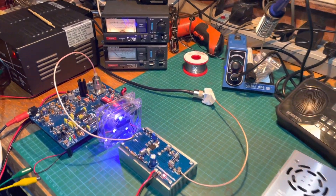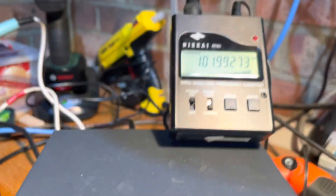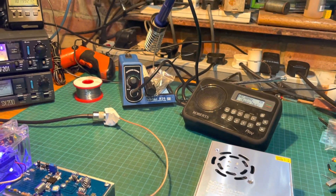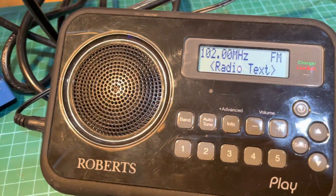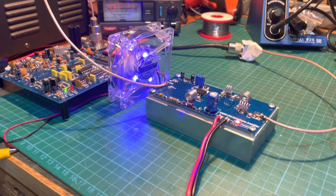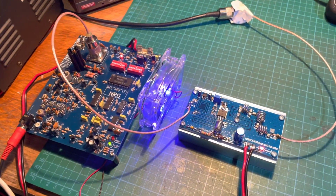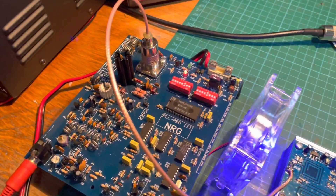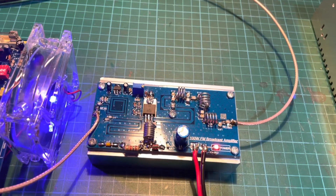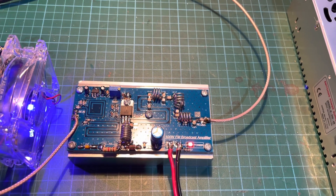All up and running. New cooling fan — just broke the other one. 120 watts, frequency 102. Radio ready to test audio, so push play and we should hear the audio. That's a good driver for a power amplifier and we're only on the one watt setting. We adjusted our bias setting and fitted the MRF 101, which is hardly getting warm at all — perfect, working well.